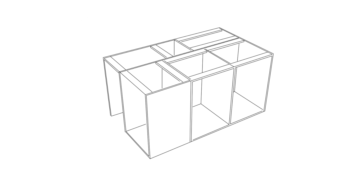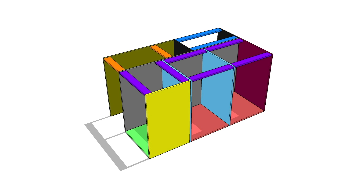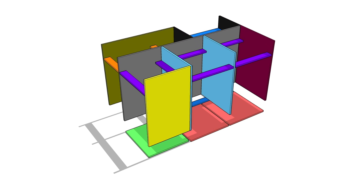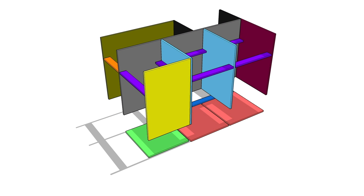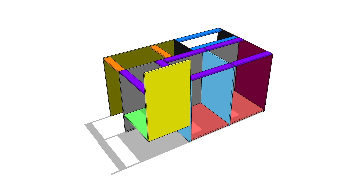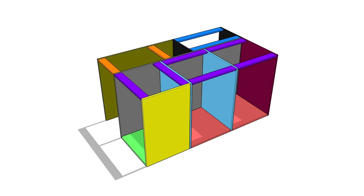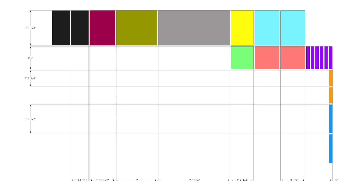Here's an example. I've color-coded all the pieces so you can see which are identical, and it looks like there are 11 unique shapes. What's important is which specific dimensions are identical, and to try to make all of those finished cuts at the exact same time. Several groups of pieces share dimensions. Here's another picture laying out each unique dimension, and if we were as efficient as possible, we'd have to set our fence a minimum of 11 times to batch out our 21 pieces.